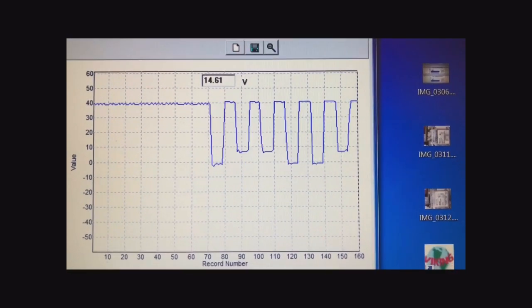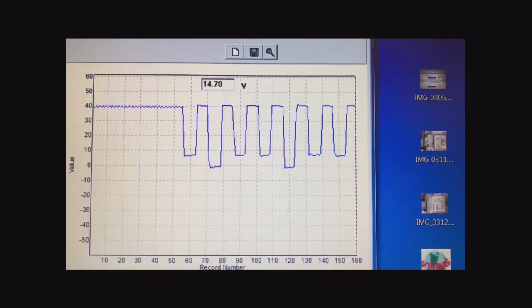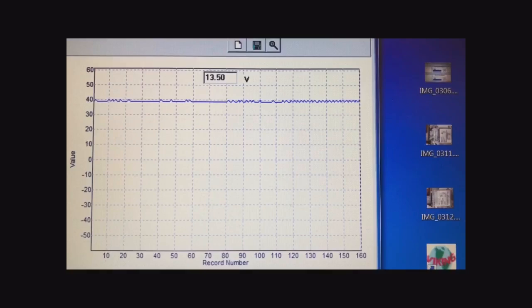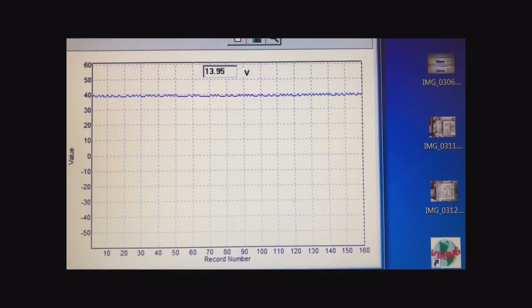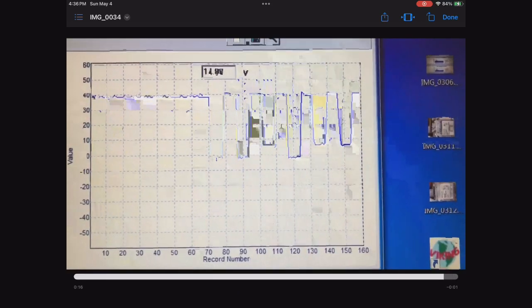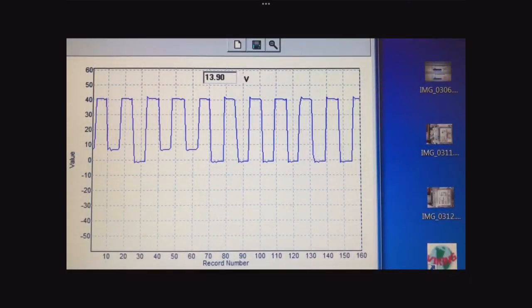It's dropping to 0. Don't pay attention to the numbers on the side. They're not accurate. But basically, you have 3 points of reference when this does this. And the references are 0, 5, and 24 volts. And I'm going to go back. Here's a nice example right there. You've got 5, 0, 5, 5, and then all zeros going across. It's basically the digital signal identifying the different devices and modules.